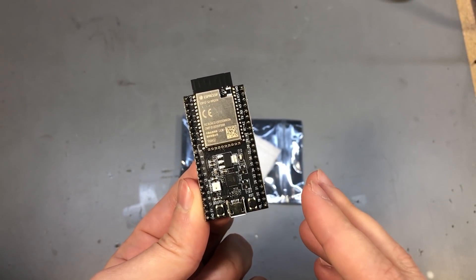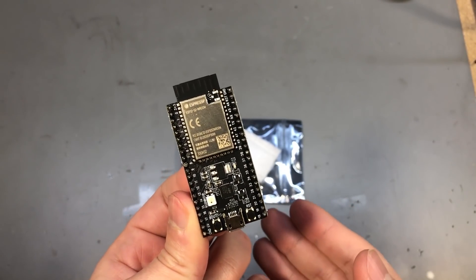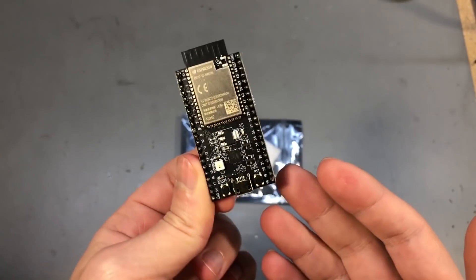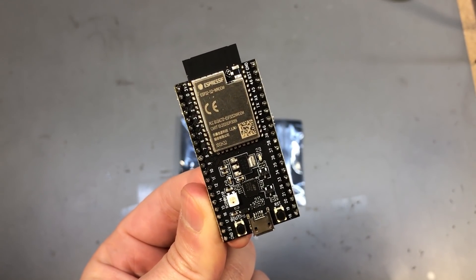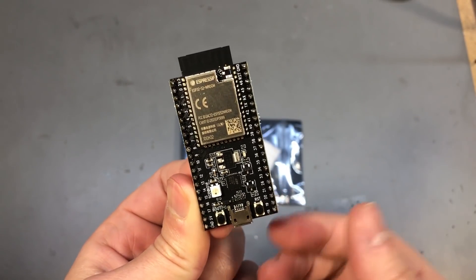My backup solution is a Raspberry Pi Zero, which I have already tested and it works, but it's more expensive, it uses more power, and it needs an SD card. So I would rather work with something like the ESP32 S2 if they eventually add USB host support, and in particular that virtual serial port.